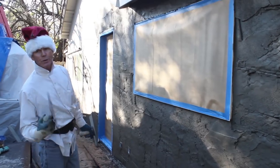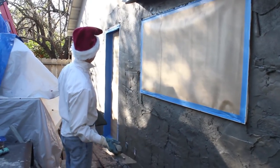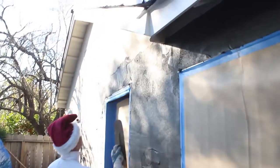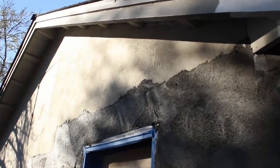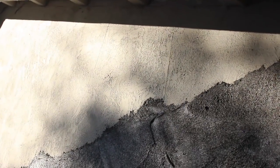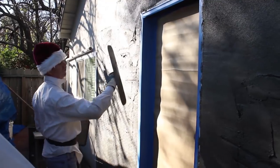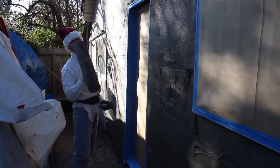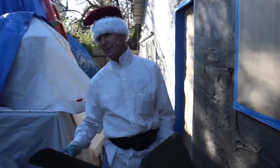While Lou is out there mixing the finish, let me show you a couple more things. You can't see it too well, but it was a float finish — the aggregate is brought out. Somebody dashed it and then hit it with a trowel lightly. It's not a skip trowel though it looks like one. To match it, we do a heavy water float finish and then take our trowel — I'll show you that after.